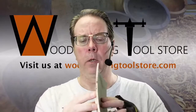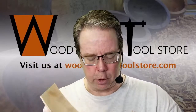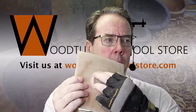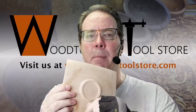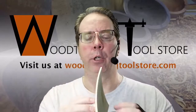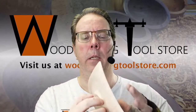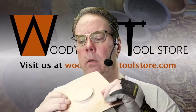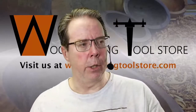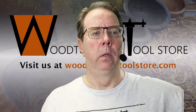I started between centers. I said, no, I can't do it that way. And so I ended up taking the inserts off the O'Donnell jaws and going with the 50 millimeter jaws there. But my tenon is too big for those 50 millimeters, so I could have made this probably another quarter inch, 5 millimeters less in diameter. But yeah, screw chuck, and that allows you to do this completely and finish this to a finish bottom. And with the little tenon, you can see, it's not good enough, but I do have chuck indents in this because I didn't get my tenon quite right. If you get your tenon just right, you won't get those indents because you'll have a perfect fit.